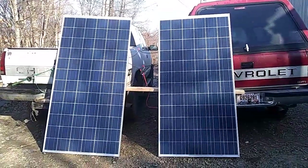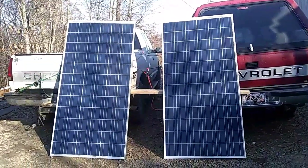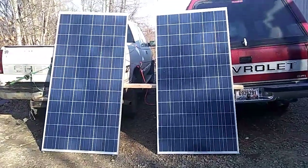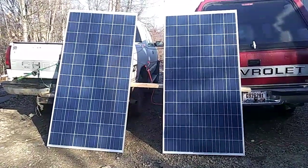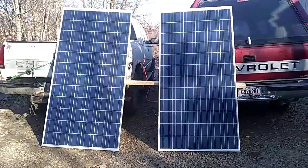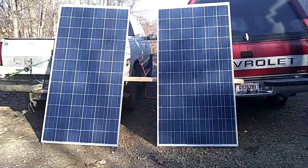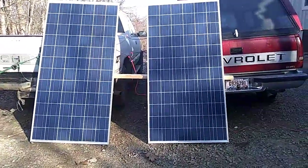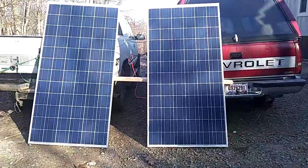Okay guys, so today's part two of the solar heater video. We have the heater inside set up with antifreeze water in it. We're running a 12-volt 300-watt heating element in it. In order to stay under that 300 watts — because when you're dealing with heating elements, it's not so much the voltage that really matters, it's the wattage you want to watch — since we only have a 300-watt element, we want to stay under that.